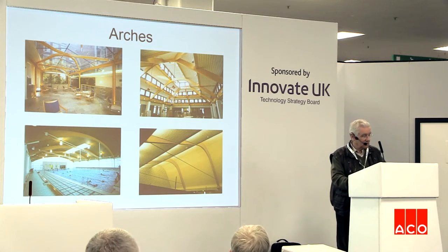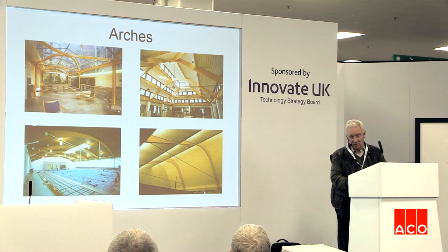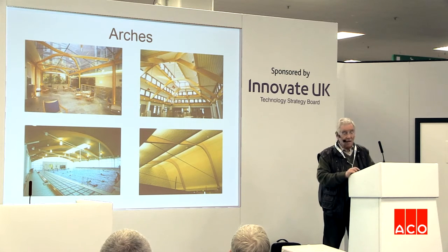The starting point is the basic curved glulam, which is the traditional vision of decorative structural timber work. The arches don't have to be symmetrical, as you can see — they don't even need to be standing vertically, like the top left-hand one there at the King's Fund. They do need to thrust at the base, so there's either a tie rod across or buttressing to resist that. Not all that versatile.